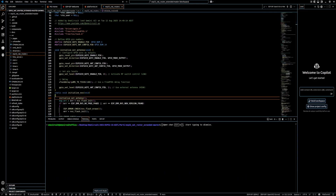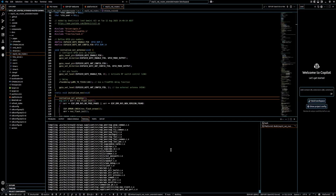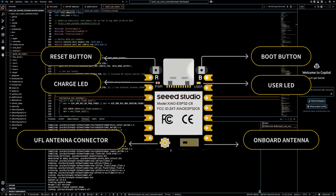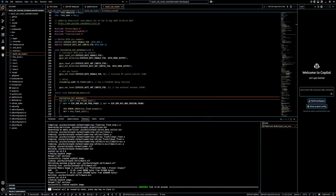How does it work? Simply at the end of the day, you just push this button. You can change your IDF version number, your port, and the target for the code down here. You press this button and it goes away and builds. It's great at reporting errors. If you have your ESP32 C6 connected in boot mode — there's a button on the ESP32 C6 itself — then it'll even upload. So this button here actually not only compiles but uploads as well, and that's all there is to it. If you have any questions about the reasoning, the code, or the process through the IDE, please leave a comment below.